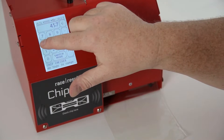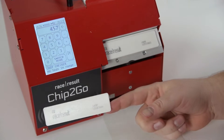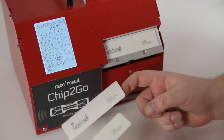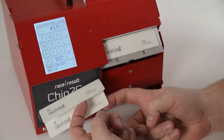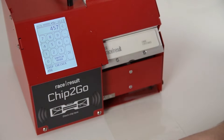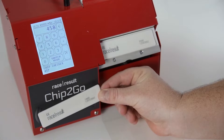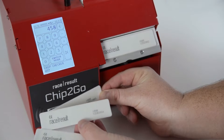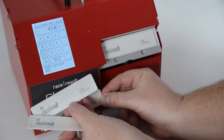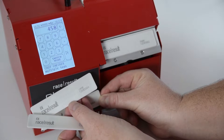If I generate another tag with 456, I can check that again and it will show me 456. If I have two chips on a bib and they're both programmed to 456, it will show you that it sees two chips with 456. Now if I make a chip with 457 and then present a 456 chip, it will detect multiple tags — meaning I'm showing different tags with different bib numbers to the check antenna. This should normally never be the case, so if you see multiple tags something is wrong.